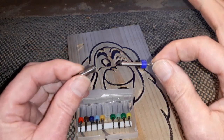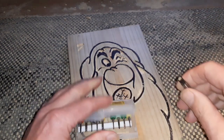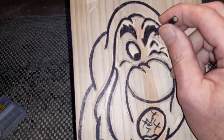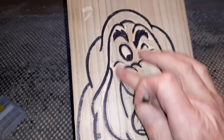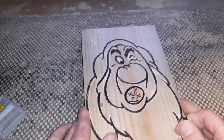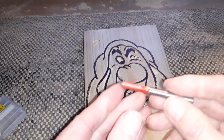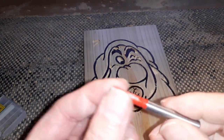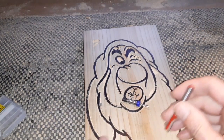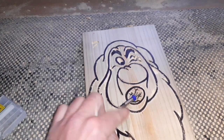Like I said previously, same size shaft, 3.175, so let's just slot in there. We'll pop that into our router. We'll set it to that depth there, one of those that we've already removed. And then basically just remove all that you see now, apart from that little black thin line. You'll soon whip it out. It is slower, like I just said there now, there are better bits or quicker bits. I'm certainly in no rush, but these are just a little bit too aggressive. But if you have a lot of clearance, certainly look at bigger sized bits. Okay, let's clear it out with the end milling bit.